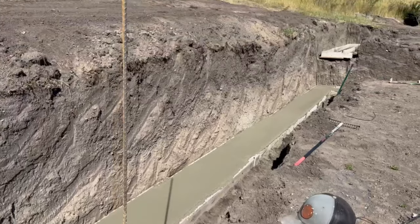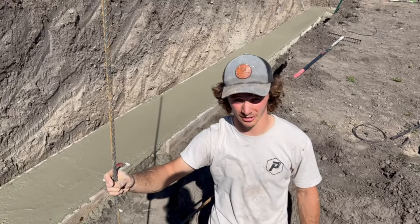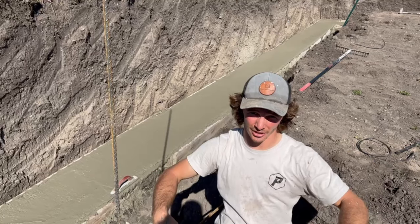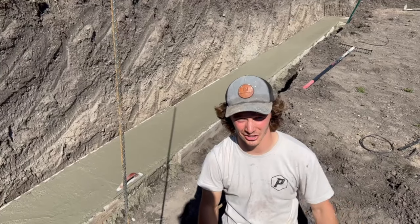What's this big rebar sticking out of the ground? This ties all of our rebar that's inside of our footings to our electrical panel. In case of lightning or anything, electricity always wants to go to the ground, and this ties it all to the footings instead of electrocuting us working on the job.